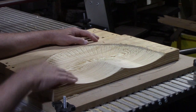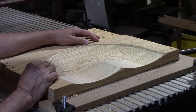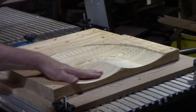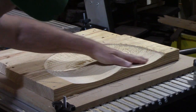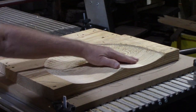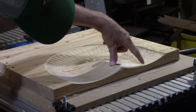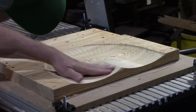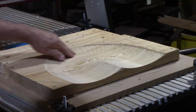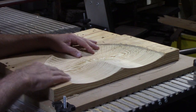I'm going to sand it a little bit and sit in it to see what I think. You can make a scalloped seat using VCarve Pro and your CNC Shark, or whatever other CNC you have, and it comes out like this. I'm going to change the depth so it's not quite as steep and won't have as big a peak. I'll also add more lines to change the spacing.